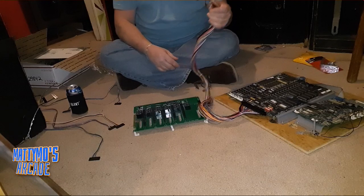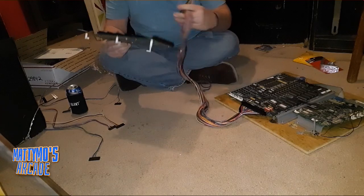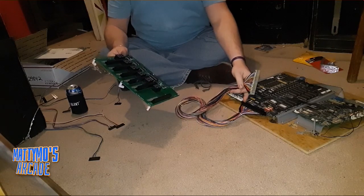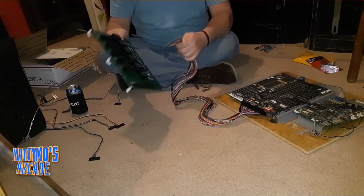On the other side, it's not marked with the 7th pin, and it's all marked in Japanese. Since we had the JAMA extenders, we were able to kind of look and match the Japanese to Japanese. You just follow where it's hooked up on the board as your 5-volt, but where to hook it up on that side, we had to match the Japanese.